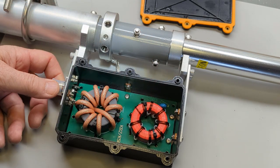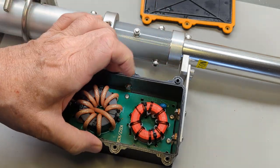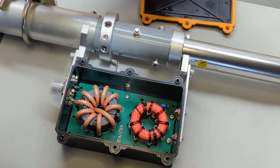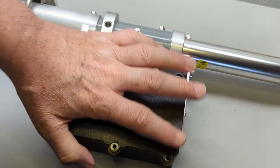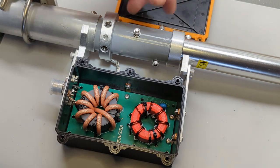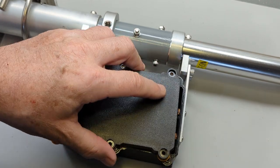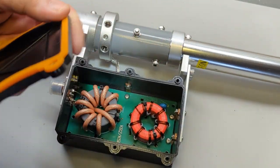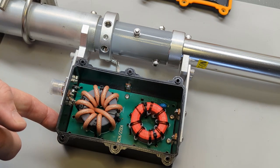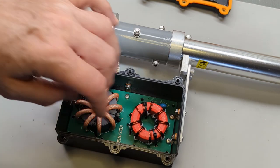So that's the design - it's minimal at best. It was designed to be inexpensive so that the antenna's price range was low and to be serviceable. The box itself isn't bad - it'll do the trick, especially when the lid is on because it adds rigidity. It's got a cheesy little gasket that's dry. I would put a little silicone very carefully applied on both sides to give it a little extra weather resistance, because I don't think it's going to survive the weather for a long time. It just doesn't seem to me that this is going to live outside in the sun, rain, heat, and UV for more than a couple of years without degrading and water getting in, even though it has a weephole.